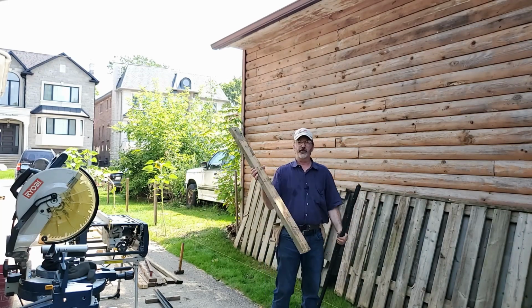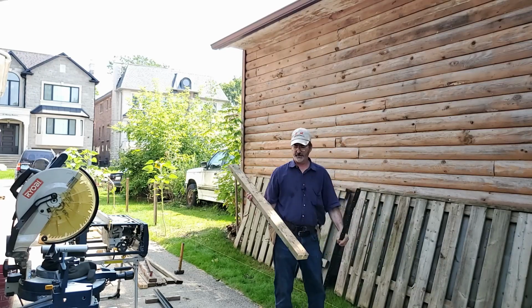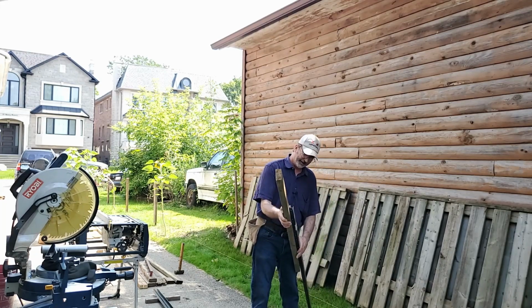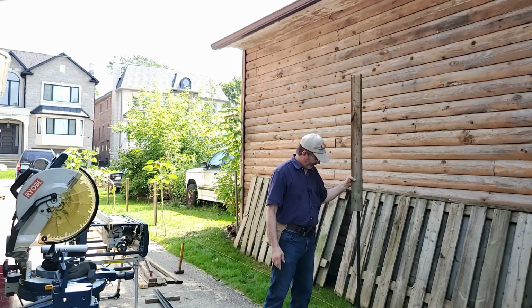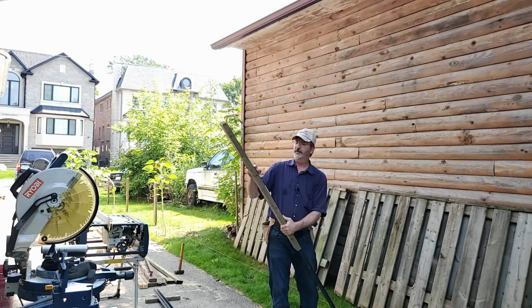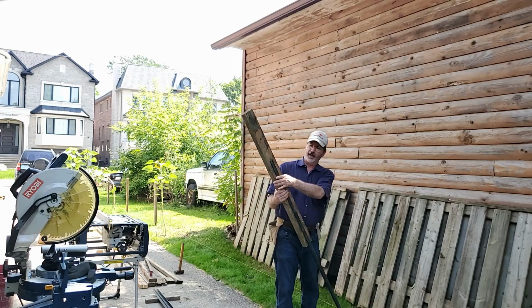I take the 2x4 that's along right here. I cut them down, and I take the table saw. I run a groove up the center, and that groove runs inside here. Then I'm not going to put it on now, but I hammer the T-post down, and then I put the PL on here, outdoor, and clamp it until it dries.